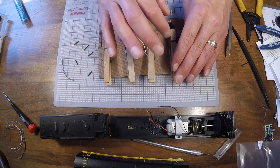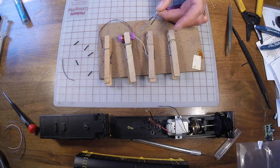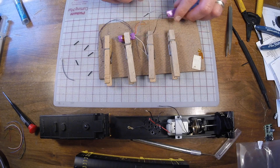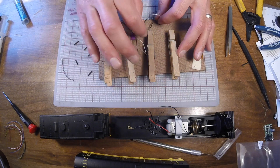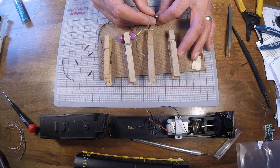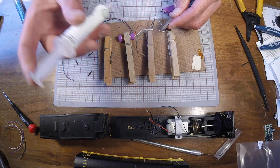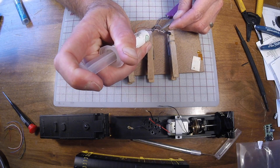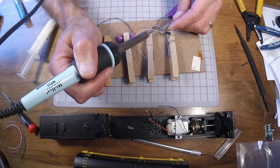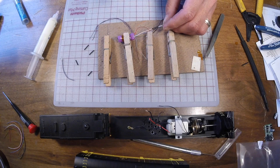With the current keeper connected, we'll go ahead and slide the heat shrink tube over the two solder joints we just completed and seal those off — that step is now complete. For the final step in this sub-assembly, we'll join the white wire from our lighting plug to the white headlight wire on the TSU-1100 harness. Apply a little bit of flux — we've already got the wires tinned so it won't take much more solder. Slide the heat shrink over, and this step is complete.